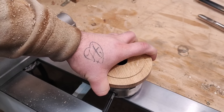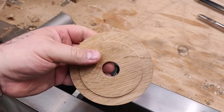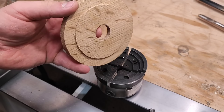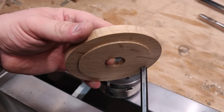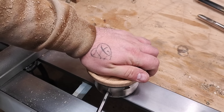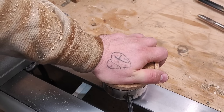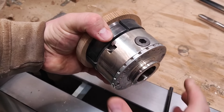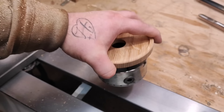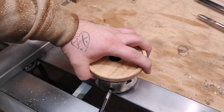I'm highly advocating that you grip the tenons instead of opening up in a recess as much as you can. Even though this is a much smaller tenon, I'll be able to put way too much force on it and still won't be able to break it. Really nice and secure — I can't tighten it up even more. The wood is not failing when you compress the tenon.